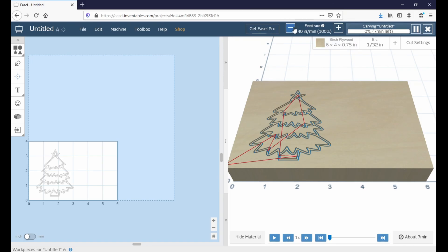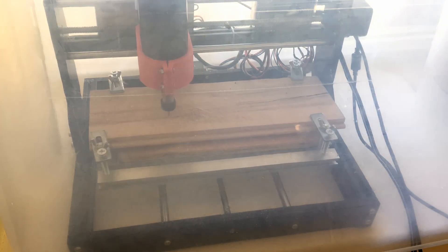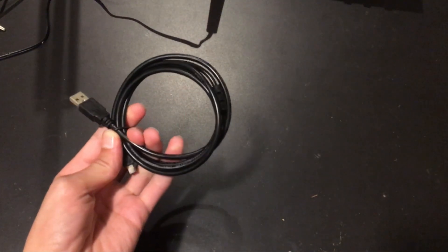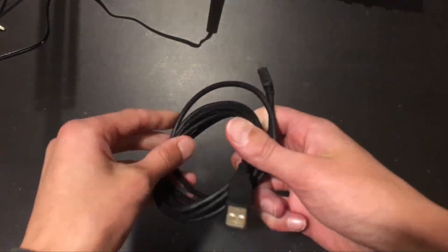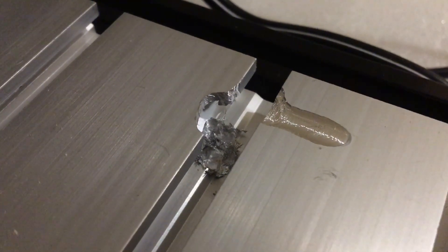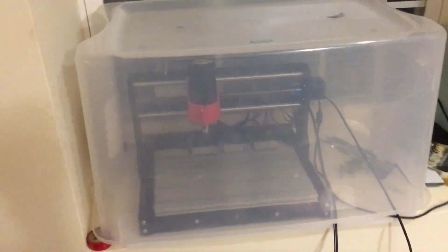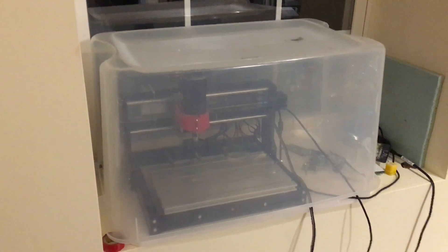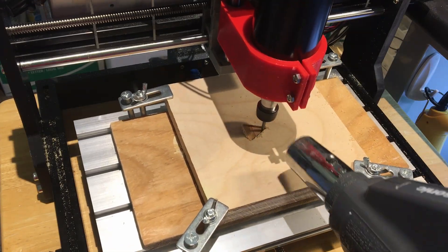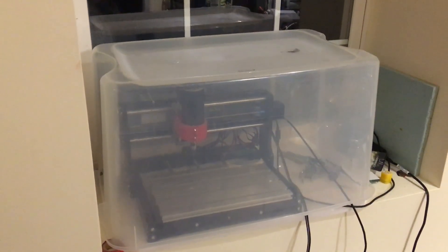After starting the carving, make sure the cut begins as you want it, and it's suggested to keep a very close eye on your CNC as it carves, because you want to be nearby if something goes wrong. You might want to think about investing a few extra dollars into a better USB cable than the one that comes with your machine — in my case, the cheap cable caused many headaches of jobs stopping in the middle for no apparent reason, or in the worst case, the bit driving down into the CNC table. When I switched out the USB cable, the problems stopped. It's also recommended that you have some kind of enclosure surrounding your CNC so that chips getting sprayed everywhere don't make a mess. I currently use a large tub to contain all the chips until after the carving is finished.